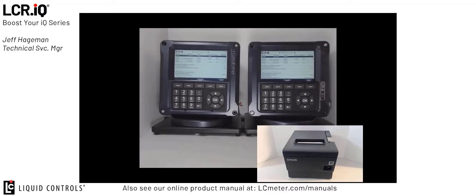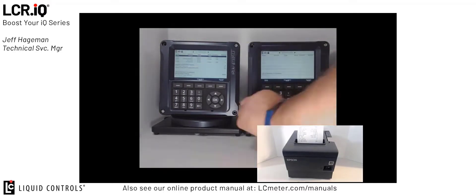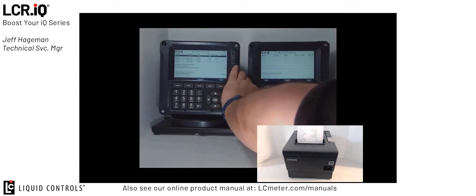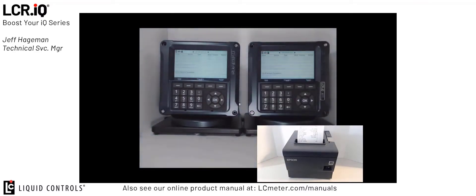Now that the hardware configuration is complete, I can place both registers back in the normal operating position by threading the bolt on the side of the register back into the housing until it's tight. I'll start with the secondary register, and you'll see once the bolt is in, a calibration ticket automatically prints on my printer. Now I'll do the same with the master register, and you'll see I get a calibration ticket from my primary register. You'll notice there's a slight time difference between printing on the primary and secondary register, due to the fact that information passed from the secondary register through the primary register takes a slight bit more time to reach the printer.